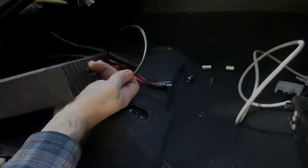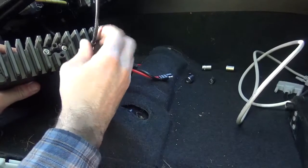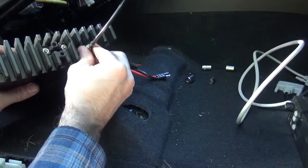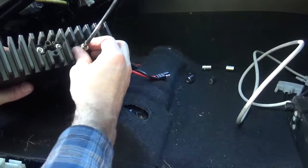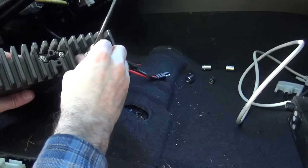First, the antenna. If you get extra coax cable coming from your antenna, do not coil it up into a tight coil. Just lay it flat randomly, maybe underneath the carpet or in a place where there's little foot traffic. If you coil it, you could have problems with matching the antenna later.